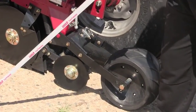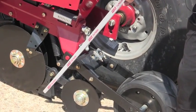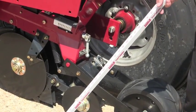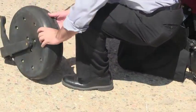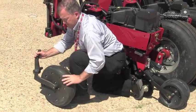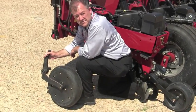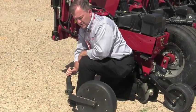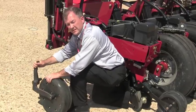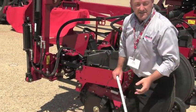The shoe keeps that mellow side wall of soil inside the seed trench from collapsing in as we go through the field, which is also important for keeping uniform depth of placement. This all sets up for the trailing gauge wheels. We maintain the trailing gauge wheel style, which avoids bumping and aggressive reactions to the forces and moments that occur when you encounter bumps in the field. Like the wheelbarrow, we can roll gently over field anomalies to navigate the terrain — easy on the row unit and allows us to place the seed consistently in the furrow.